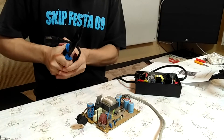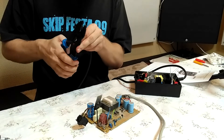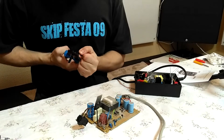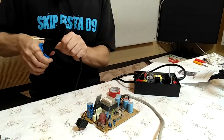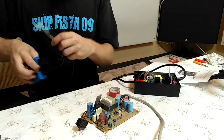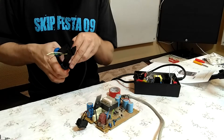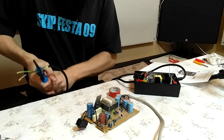That's why I actually did this. You just strip the cable end. The new power supply is a switching power supply, so you can use it in the US or the UK. I stripped off the end and you can see three cables coming out now — one's ground, one's live, and one's neutral. Check the internet for which one's which in the country where you live.